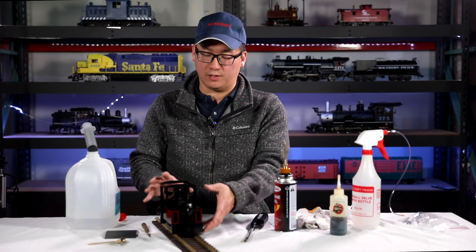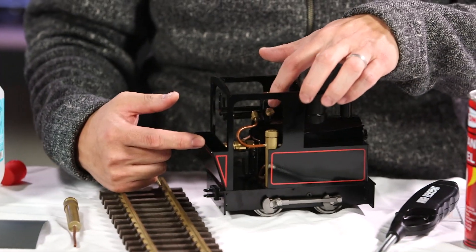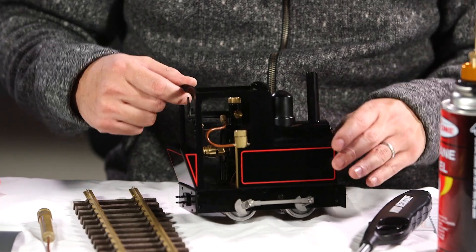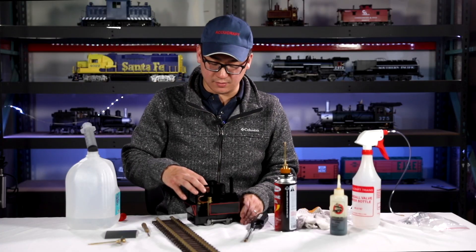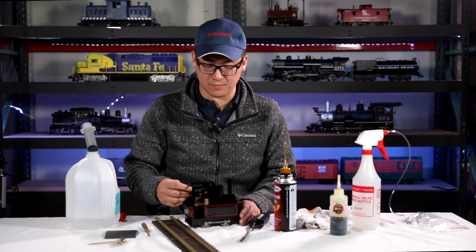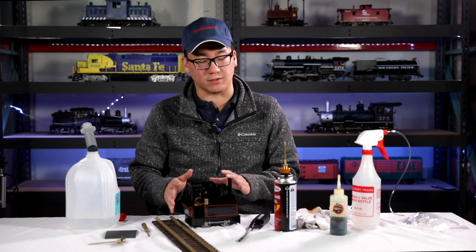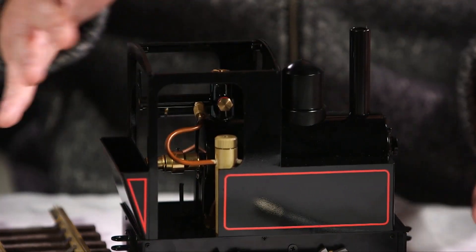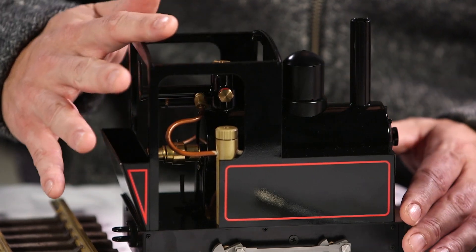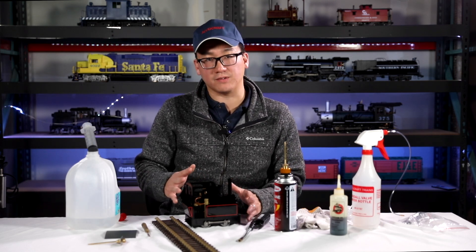That's the basics of the Dora. One thing you can do is add a pressure gauge — that's where this goes; this is the blank part of a boiler turret. We have a video that describes how to install it on our YouTube channel, and we'll put a link in the description. You don't need it to run this model, but some people like to see how much pressure they have. Usually you're running at about 30 to 40 psi for this small model; larger models can get up to 65 psi, and that's when their safeties will start popping.